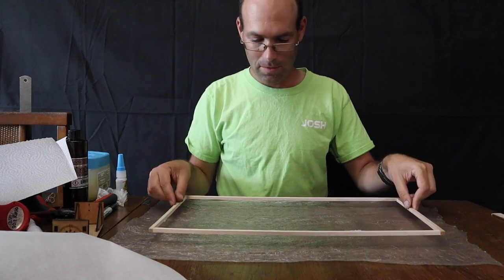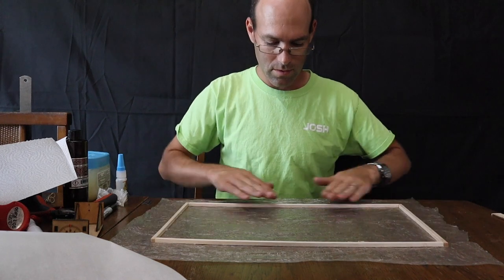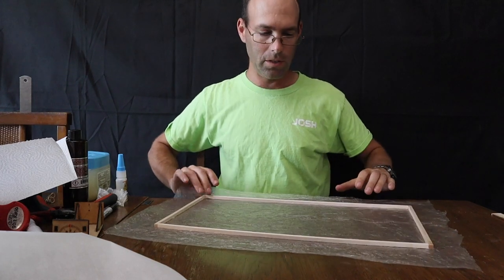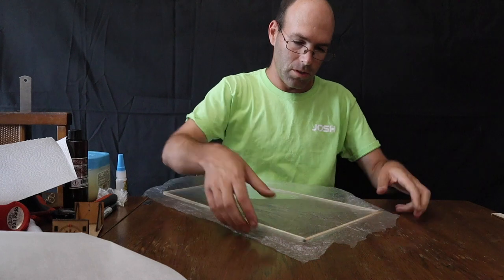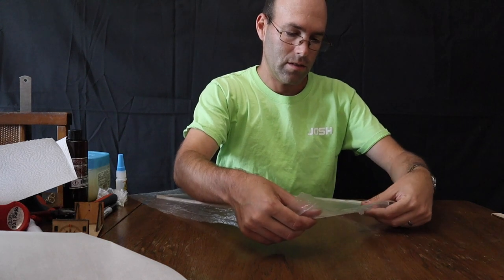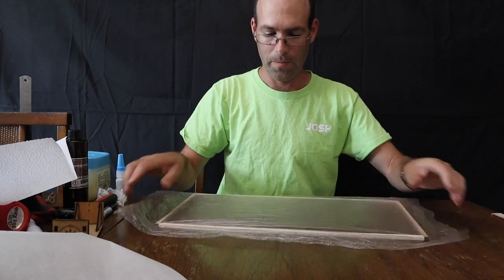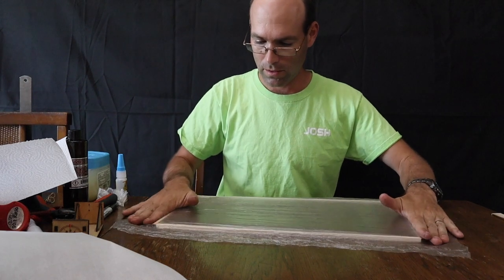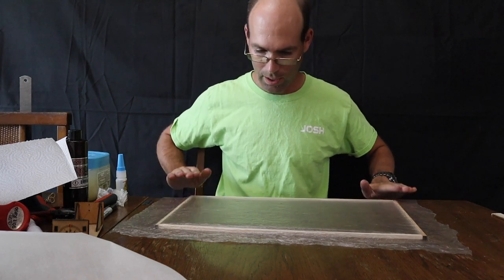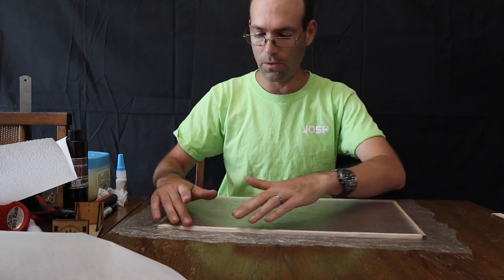Sticky side down, by the way. The sticky side has to stick to the covering. Now this film is not perfectly tight at this point. You can flip the film over. You can start to stretch it tight. It is more important for the film to be tight in this direction than it is this direction. We will take out some of the slack here, but we're going to concentrate on that direction, as that is what forces the film to adhere to your airfoil shape on your wings.